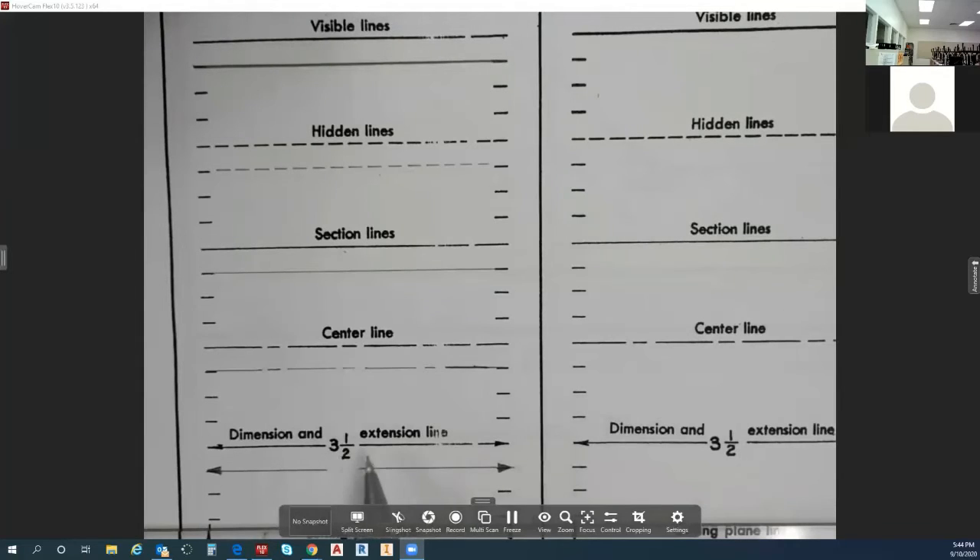So, dimension line — leave a little break, match up with this break. I do want you to notice that this three is centered with the line — that's your whole number. Your fraction line, the little slash, is lined up perfectly with the dimension line. Your one and your two are each one-eighth of an inch tall. The whole thing ends up being just bigger than a quarter inch because you've got some space. So when you draw dimension lines on your drawings, center your whole number, your fraction gets centered right on the line, and each one's an eighth tall.